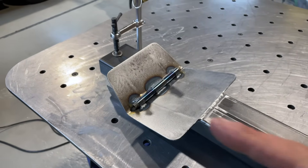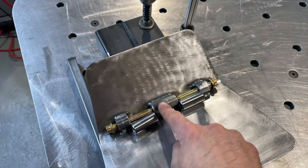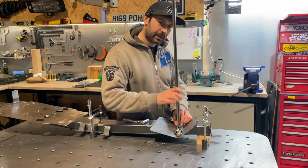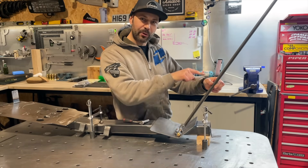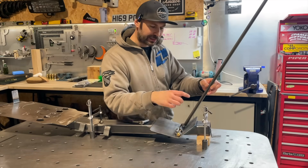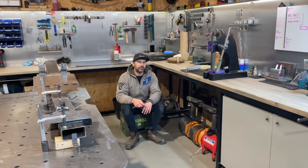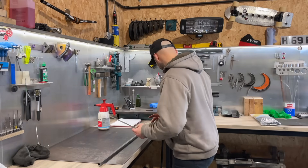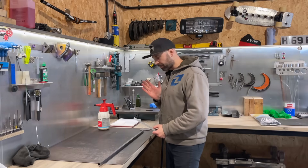Here we have it — just got to let this cool down, then hopefully I can get these two bushes out and start making some pedals. I've stripped all that now so it's looking good. The bolt holds it together, the pivot sits in there with some grease, and the pedals will go like that. I need to make a pedal arm — I'll weld that on there. I'm not sure how long to make it, but I can always make it smaller. Logic says I should measure my foot — about 275mm without boots. Allowing for a pad to overhang, I'll make a nice round 200mm.